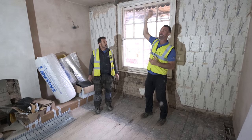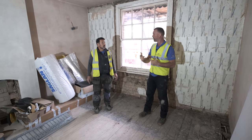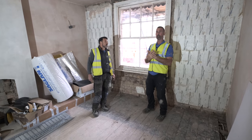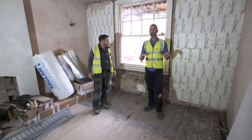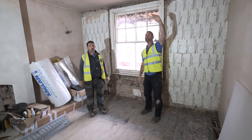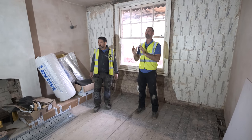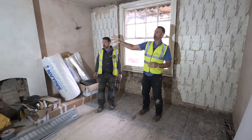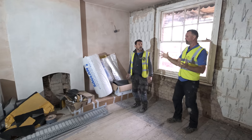The existing people had loaded the dormer onto one joist — literally put all of the load on one joist. So we needed to put another two joists alongside it, triple joists, to give enough support to the vertical dormer, and we doubled up the rafters. That allowed us to address the room in the right manner. We've had to over-skim relevant walls, re-skim the ceiling. The doorway has been moved to the central of the room for the walk-in wardrobe. We've put sound block on all walls connecting to the next door neighbour.